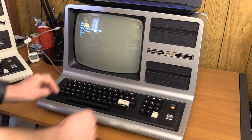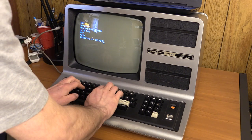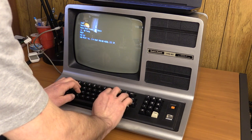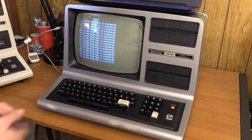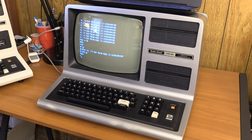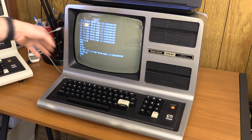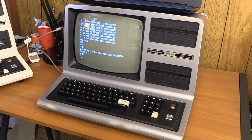There it is — look at that. My TRS-80 Model 3 microcomputer. It works. It didn't work when I got it. There were two issues: the video driver board that came with it had an issue, but fortunately I had a spare floating around — it was analog from an early Model 4. And then there was a break in the deflection coil, in the yoke — the horizontal coil had a break in it. We found that and got it all fixed up. CRT adjusted. And now it is ready for upgrades. Thanks for watching. We'll see you next time.